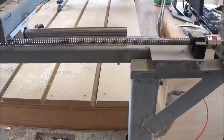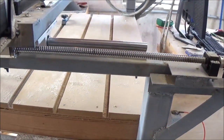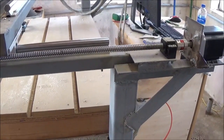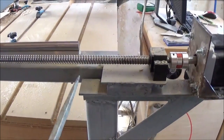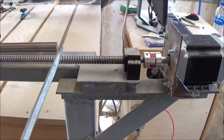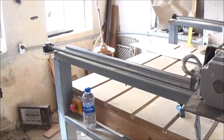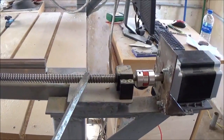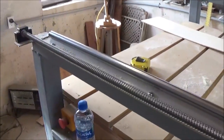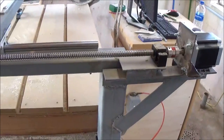The next question is why I used a five-foot ball screw when I used a four-foot linear rail. You can use a four-foot linear rail and a four-foot ball screw. Two reasons I did this: one, I didn't want to be that confined with space — my motor would be right behind it and spacing would have to be perfect. Second, I found the five-foot ones on sale for about twenty dollars cheaper per ball screw since they were an odd size. Saving money was probably the biggest reason.